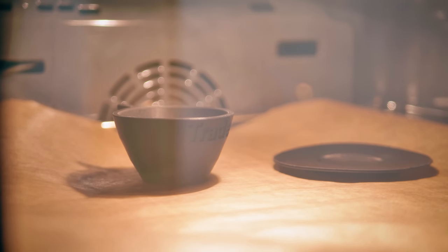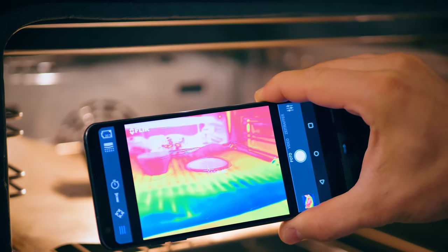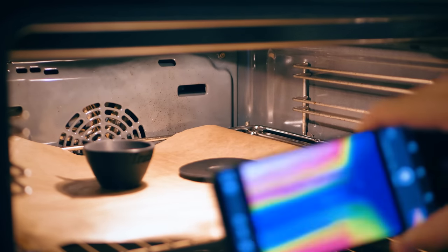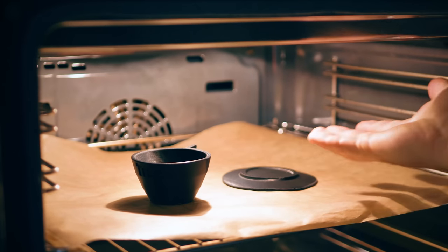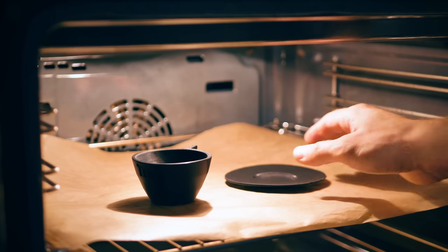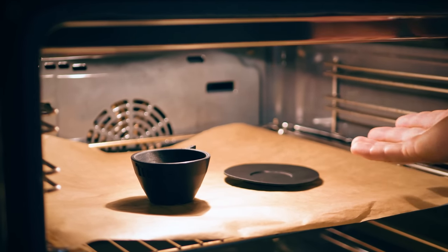In those remaining 25 minutes, nothing really changed, so I'm thinking the crystallization of these parts already occurred in those first few minutes. The oven says we're done — let's give it another quick check. 114, 111. It actually smells good — warm PLA smells so nice! The one thing I can already say is, even though these parts are hot — they're in the oven at 110 — they're not soft. These are hard, these don't bend like a PLA would. Overall these have not melted, which means something worked.